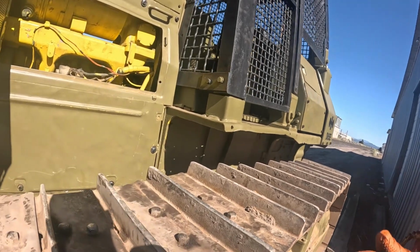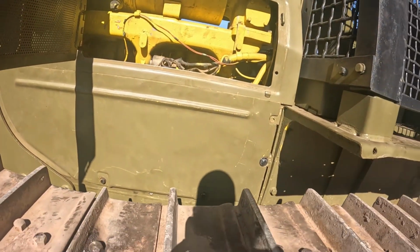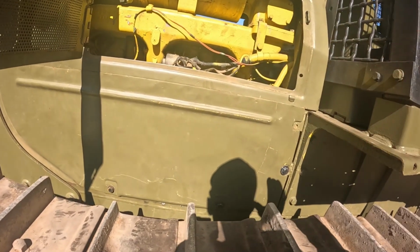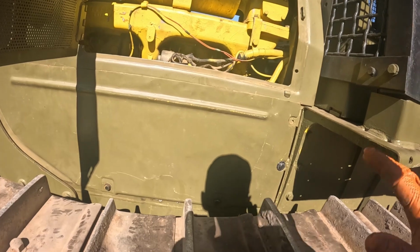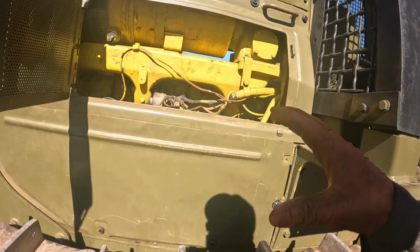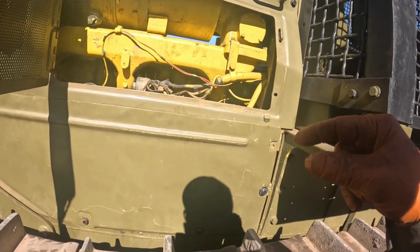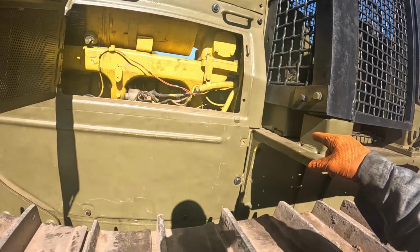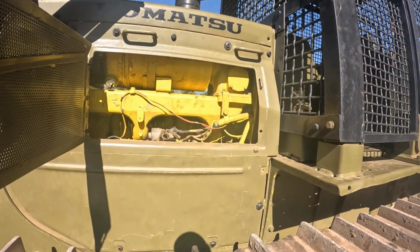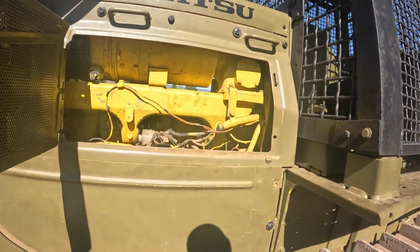So within a regular injection pump with the tank sitting higher than the pump, the way the injectors are made with the plungers and what do you call them? I'm having a brain fart. But anyways, the way this was designed with this PT pump and the way those flange style injectors are, there's nothing really to keep the fuel from running straight down the line back through the pump right down into the cylinders. That's what I found in a service manual that was describing how this worked on this Komatsu.